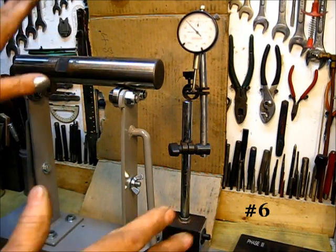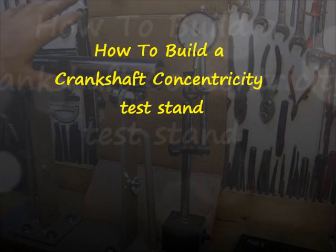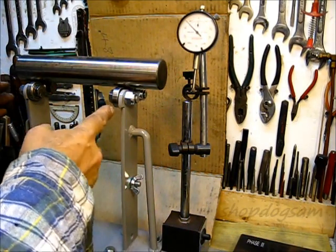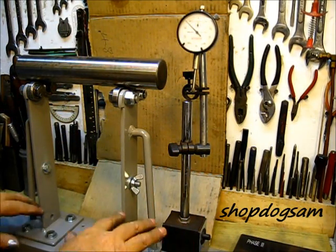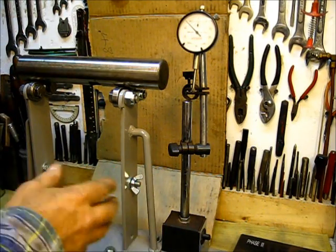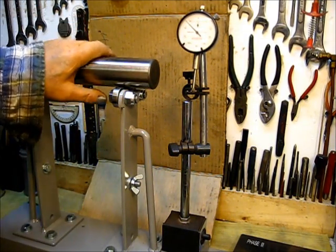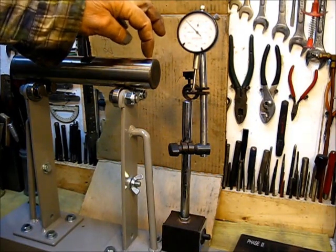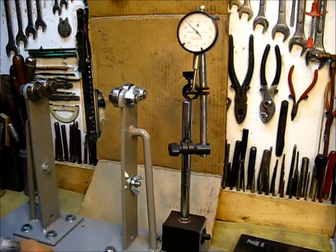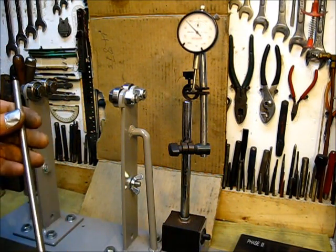What it is, it's to check crankshafts in my shop. This right here is just a kingpin out of something — it's really true and straight. I put it on there as I was tightening up all of these bolts so that it would all be true to itself. If you wanted to know if this was straight, you would put the indicator right here and rotate it to see what the movement was. That's five-sixteenths drill rod right there.